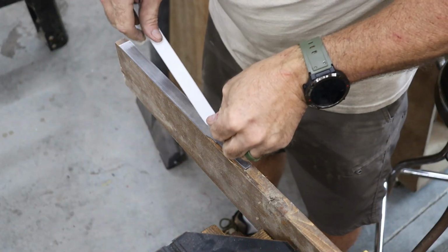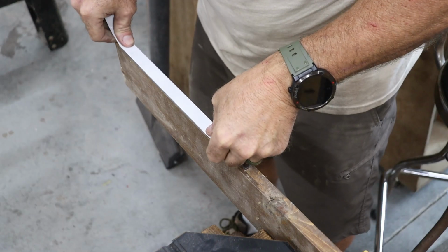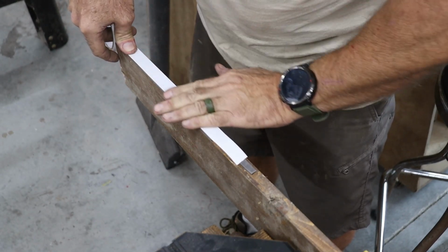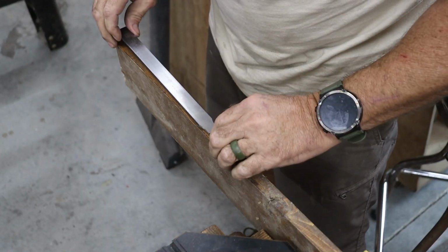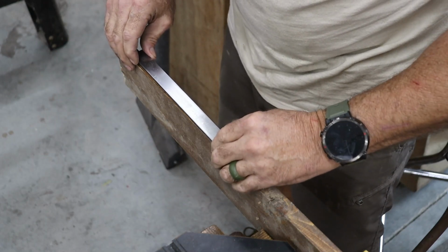With the blades shaped, it's time to start working on the bevel edges. The decorative bevel along the top edge isn't just for looks, though it does add some style points. It also softens the edge and helps the chisel sneak into tight corners without scraping up everything around it. Form and function just the way we like it.